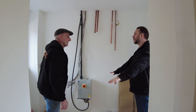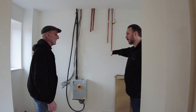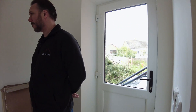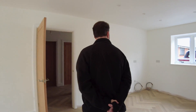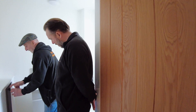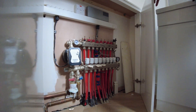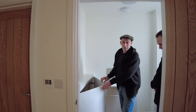Inside, that's where everything will go — just water tanks, a sink, and the washing machine. Your cylinder for the heat pump is going on the other side of that wall, straight through — easy. And there are the pipes for upstairs and downstairs; they run straight under the floor through the insulation. All the valves are inside here — the underfloor manifold and everything. The 28mm pipes from there go to the pump. It wasn't quite tidy enough, so we put a cover on it.